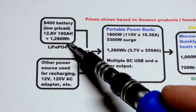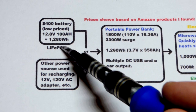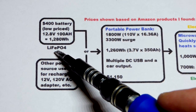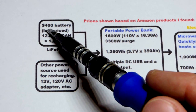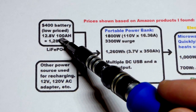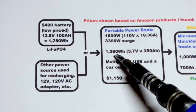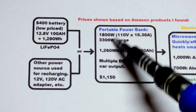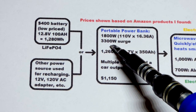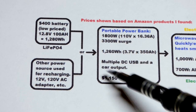If we just bought batteries to get that much energy storage - looking at the battery alone - there's a lithium iron phosphate battery at the lowest price: $400, 12.8 volts, 100 amp-hours, giving 1,280 watt-hours. So for $400 you get as much energy storage as this unit for almost $1,200 - about a third of the price. But there's no AC output or anything; you'd have to buy that separately, plus connectors and other components. The all-in-one unit has everything integrated, and the internal connections are already large enough - you don't have to worry about that.